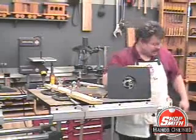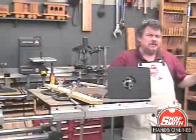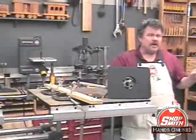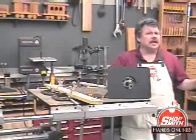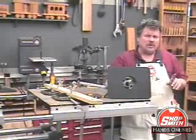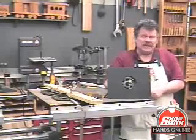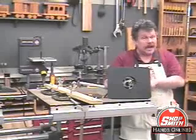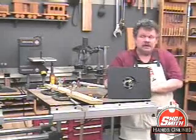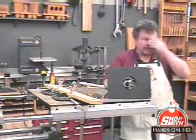And that's another thing to consider, is that we made these pieces long enough. They're actually a little longer than 24 inches. We made them long enough so that we could knock off the ends and still get the pieces we need. You may need, depending on what you're doing, to make some pieces in the lamination longer than others. The outside of the curve is going to take more wood than the inside of the curve. So there you go. Anything else? All right.